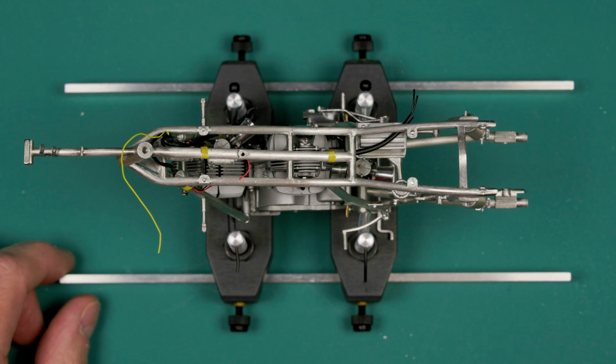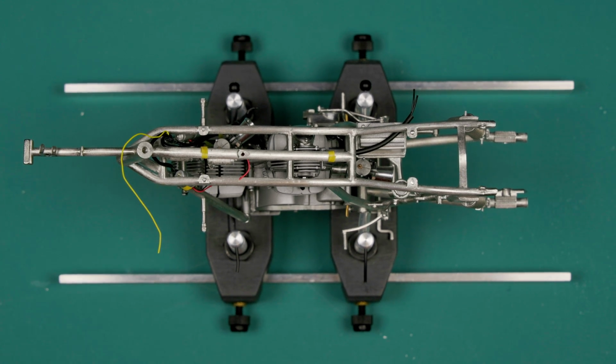Really, it's all technique. Once you get the technique, like I demonstrated, it is extremely easy actually, and it solders extremely well. If that's not happening, stop. Figure out what's going on. Figure out why solder is not flowing into a joint. Figure out why the solder is not wetting the surface. And when we say wetting when you're soldering, that means that the solder is flowing over the base material, and visibly you can see it sticking to it. It's not just beading up and creating little blobs. If it's blobbing and it's looking like some sort of booger weld thing going on, stop, because something's wrong.